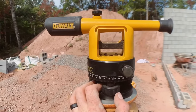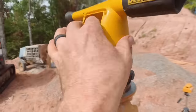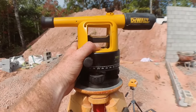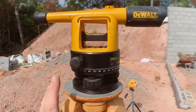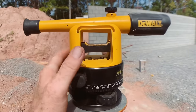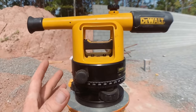In comparison, here is our old scope. It is not auto leveling. You have to turn the scope in line and then level it, spin it, level it, use this bubble — and while you can get it nice and level, the very way you use it can knock it out of level. By touching it and spinning it, you can bump it out of level, and then you're in trouble because you may have done half a project and then bumped your level by accident and have to start over. That's one huge disadvantage — it does not stay auto leveled and you're actually touching the part that has to stay perfectly level.